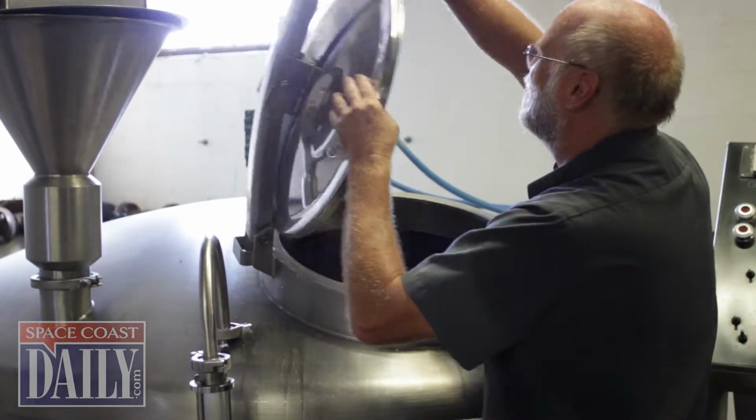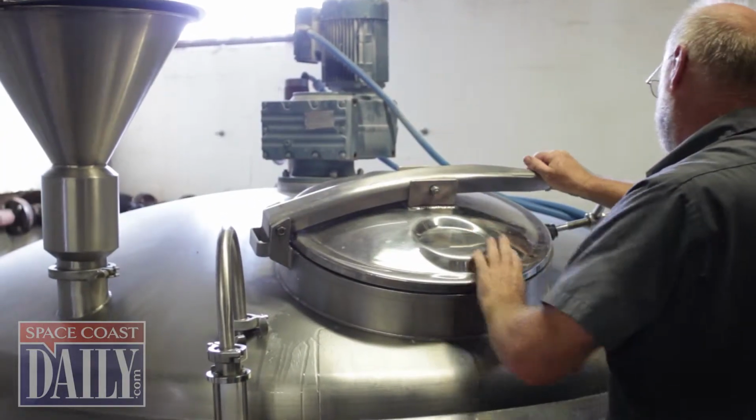The enzymes are all in this dried out seed, which won't grow anymore, but we mill it, we put it into a mash tun, and we'll run it through a temperature profile. You get it to the right temperatures for the enzymes, and in about 15 minutes, they'll convert all the starch in that seed into sugars. So we'll end up with a mash, and it's just like a giant bowl of self-sweetening hot cereal. It'll be about 22-23% sugars.